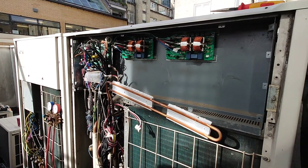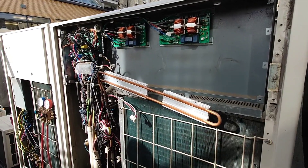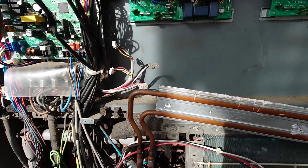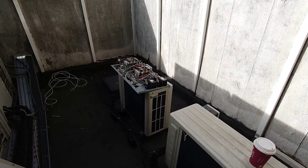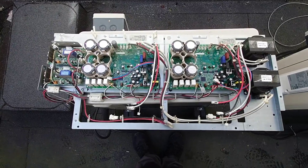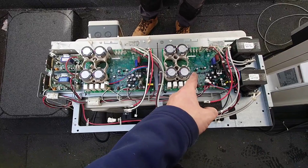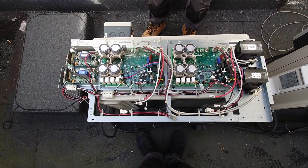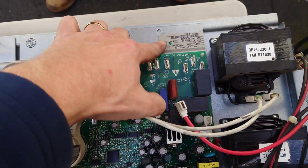The inverter plate is now removed from the condenser — or tilted over — you can see we've bent the heat sink out of the way. Now you've got the two sets of compressor cables, one and two, which you can disconnect to remove it completely away from the condenser. Because there's two of us we could potentially change this PCB without taking it out completely, but we're going to do it anyway just to show you how easy it is.